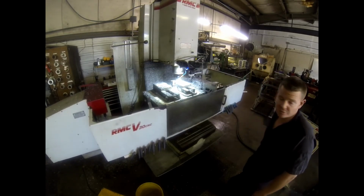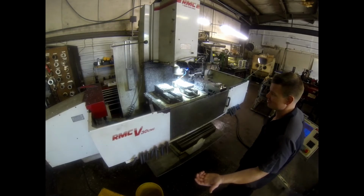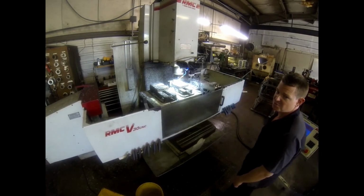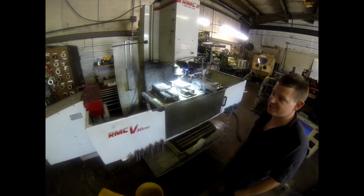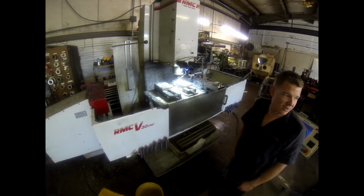Slowing this one down too. This is the contour finish pass. So I like to run the finish pass a little slower. Give a good surface finish. This was still set at 46 inches a minute, which is my roughing. So I got it manually back down to 36. Let's see what it looks like. I might slow it down a little bit more.